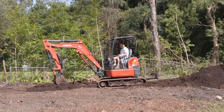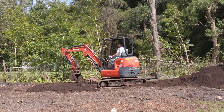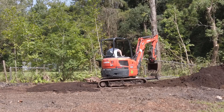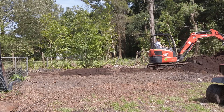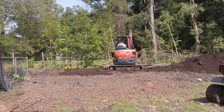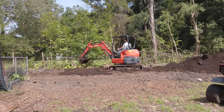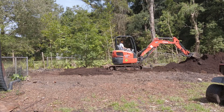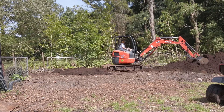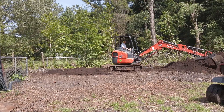That's not really a problem if you're looking to put in a brand new well. But if you want to build a building, you have to take that into consideration. Three words: hydrostatic uplift forces. Essentially, the water comes up from below the foundation and pushes on it, acting like a hydraulic. Then in the dry season it recedes, next wet season rolls around it comes back up - more uplift forces. It doesn't cause a problem the first season, second, maybe even third through sixth. But over time, that repeated pressure can weaken the whole structure.